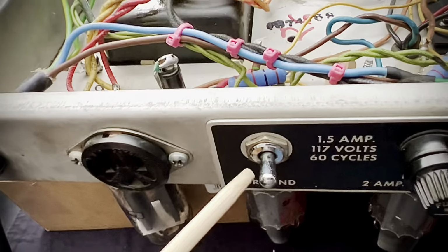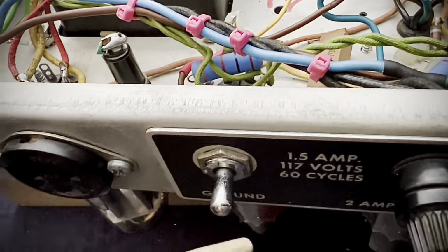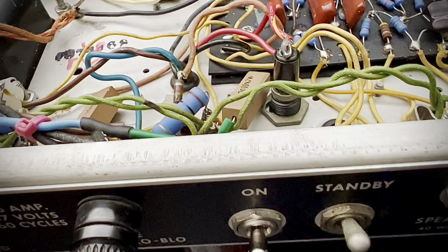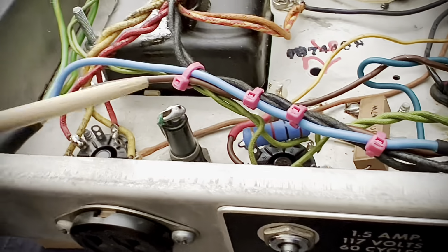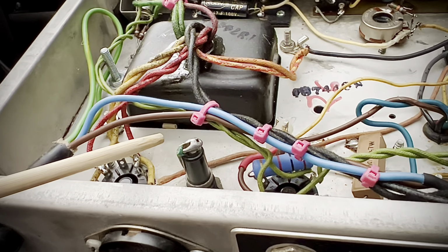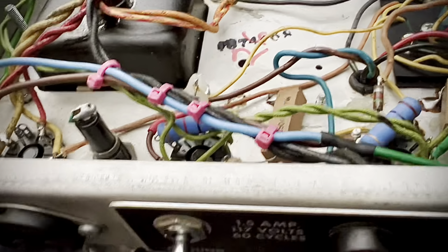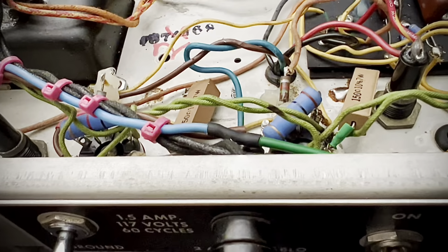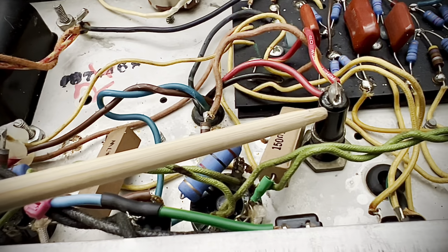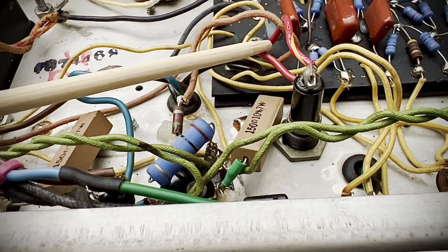And this is a dummy switch. It will not operate. It's the only thing I could fit here with the stuff I had on hand. I had to put a new power switch in there for you. No worries on that. This was the fuse for your DC heater supply. We don't need that. We have two fusible resistors here going to ground as an artificial center tap. I'm going to leave this fuse here off the plate supply. He already made a hole, so I'm not going to pop that out for something I think is of benefit.